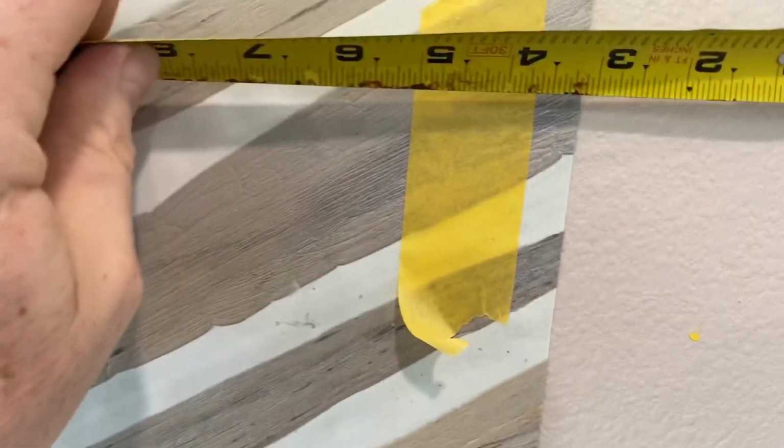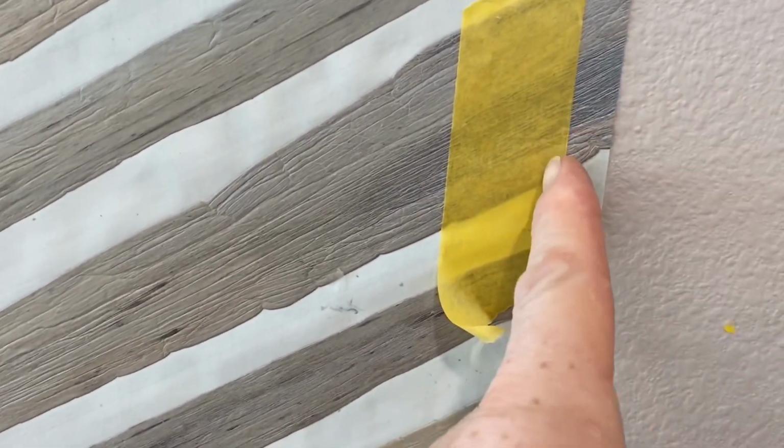Of course, we're going to work out all of these little air pockets. If you see, they're working out already over here. So to do our double cut, like we did over there, we're going to put a 1/2 inch line from our edge, and then we'll put a laser line on this line so that when we overlap it and we block this, we'll know where to cut it, right?